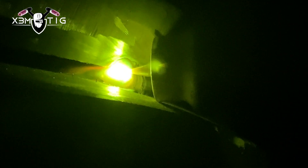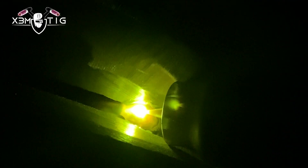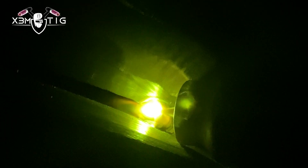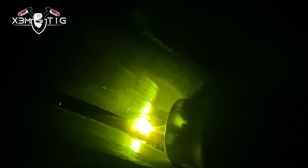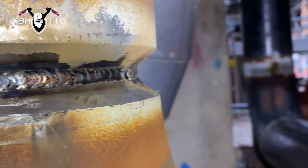70S2 is specifically designed as a rod for dirty applications — this is one good example of that, especially when it's not properly cleaned inside. I always like to clean a couple inches from the inside; it'll be a little bit easier to control that puddle. But it's not always ideal — that's the beauty of the field. Just try to keep that rod in the puddle. If you lose connection, just feed it back. Maintain constant feed, run it through your fingers, keep it connected, stretch that puddle. You can see the build-up — you've got a lot of meat inside.